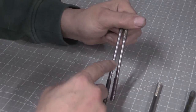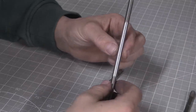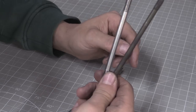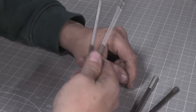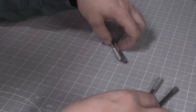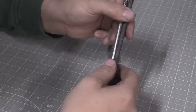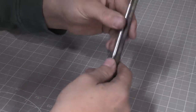And because, like I said, because they're the same diameter, we can apples for apples it. And because these stainless ones have a larger cross-sectional diameter, we can even then calculate it and find out how, you know, in service, what's the difference. So this is a test of what's the difference between the materials. That's what this is, the tensile strength of the two materials directly compared to each other. The length doesn't matter. You can make these 20 kilometers long, it doesn't matter. Then we can actually calculate, based off them results, what the actual real-world application is.